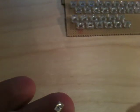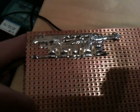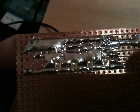These are blue LEDs and they take a forward voltage of about 3 volts, and rather impressively a current which is measured not in milliamps but in amps — they take 1 amp forward current. Here's an example of a circuit board I've made with four of these. Very difficult to solder onto strip board because of course they're surface mount, and they need a big heat sink which I've made out of solder. It looks a right mess, but they do look quite nice, so I'm going to see if I can illuminate them.